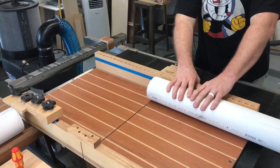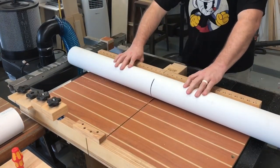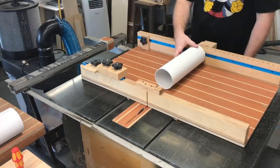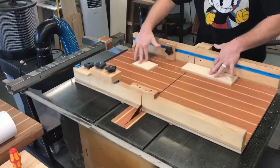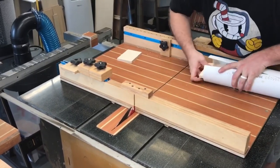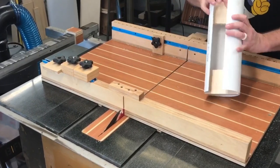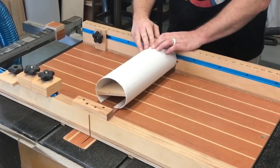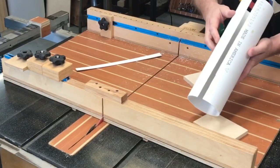To get this thing started, I'm going to trim up one side of the PVC pipe. I'm doing this on my crosscut sled with the blade raised 1 1/8 of an inch above the surface. I'm cutting one piece at 24 inches and another at 14 inches. At this point, I'm going to rip one piece down and separate the surfaces. I'm going to cut two 5-inch spacer blocks and then widen the actual PVC with the 5-inch spacer blocks. That way, when I make the next cut to cut 3/4 of an inch off one side, I don't want it springing back into the blade. And those spacer blocks really do the job nicely.